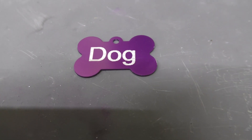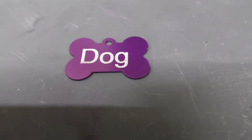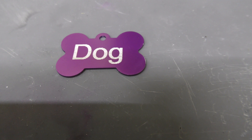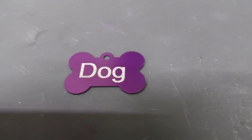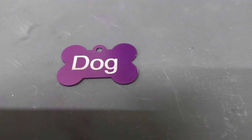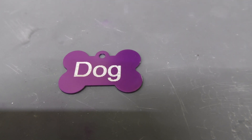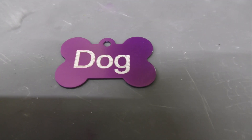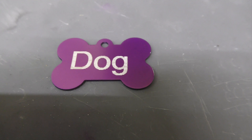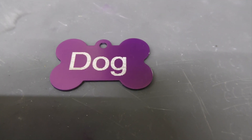The last thing I was going to do today — I've got some anodized dog tags, and I assume they're anodized aluminum. I know that you need a fiber laser for engraving metals, but I just wondered what the anodizing would actually do, whether you can use a CO2 laser. So I just chucked one in there, got it roughly aligned, and fired off the laser at about 25-30 percent.